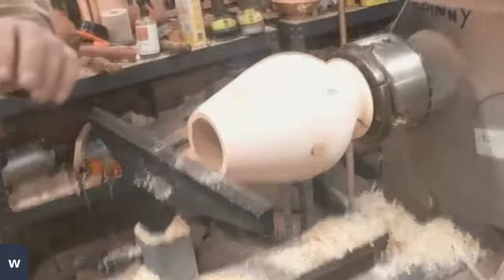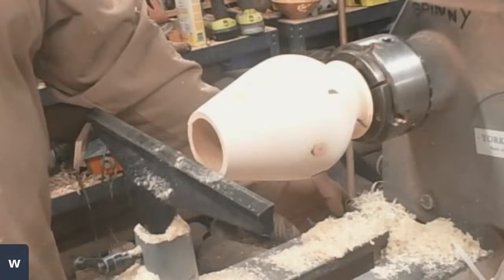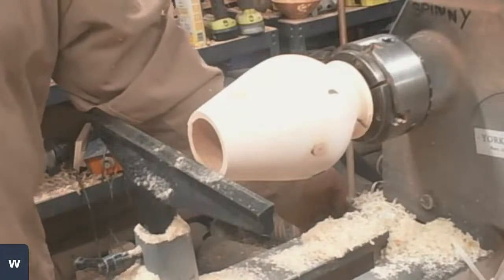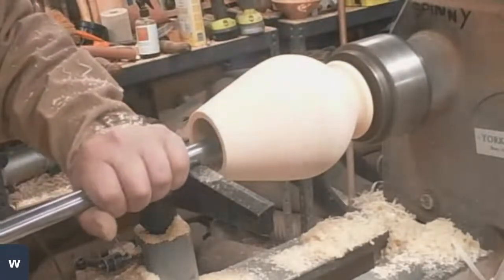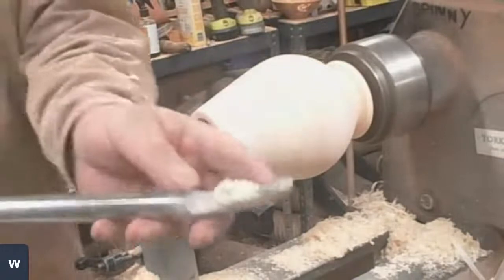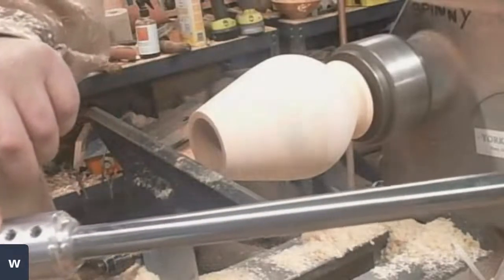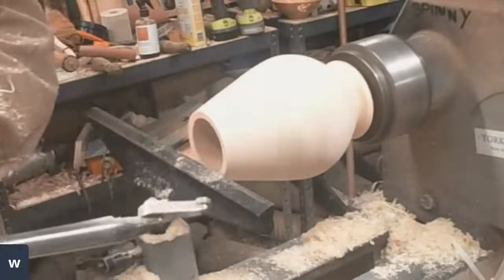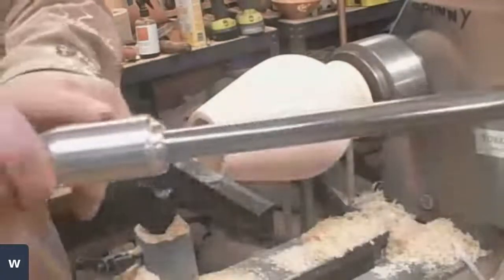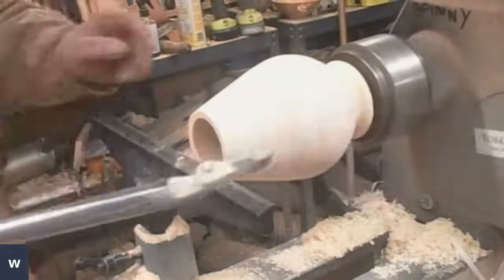Douglas Mungum says, "All hail the Wood Jedi. Are pull cuts better than push cuts when hollowing like you are doing?" I think so, yes. And what I've done with this, I'll show you the tip first. I've got the tip lined up with the 3 Allen screws that hold the bar in, so I can tell when the cutter is horizontal. And if I want, I can use the Allen keys so I can turn it on its side and tell what angle it's at.